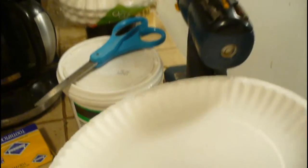The next thing you're going to need: you're going to make a hole, and this one's going to be seven inches. Here's a little paper plate — in case I don't finish the job today, I want to cover that hole. I'll stick that paper plate in the hole up top side like that, and put a little piece of tape on it. Because if you have to leave that hole open for more than a few hours and you're not around, you can have anything crawl down in it — rats, mice, all kinds of stuff — no matter how well you seal up your attic.